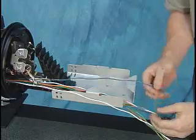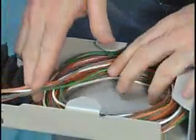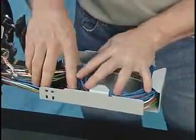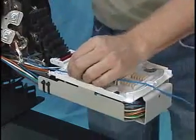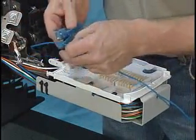Separate the designated buffer tubes to be routed and spliced from the expressed buffer tubes. Store the expressed buffer tubes in the bottom of the basket first, placing the designated buffer tubes on top, allowing easy accessibility in the future. To splice, route, mark, ring cut, and remove the excess buffer tube and clean the fibers per your approved practices.